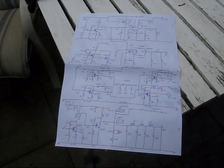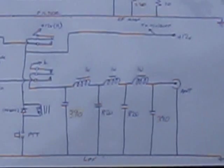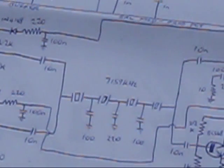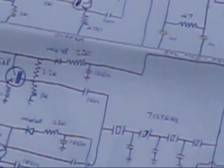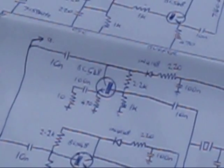I haven't explained the receiver very much, so we'll trace how its signal comes in. It goes through the antenna connection, through the low-pass filter, and then through the relay — following the normally-closed contacts — into a transistor amplifier. That circuit amplifies the signal and passes it to the crystal filter, where it lops off signals other than what you're trying to receive. The signal is very feeble still, so it goes to another transistor amplifier where it's boosted up to a reasonable strength.